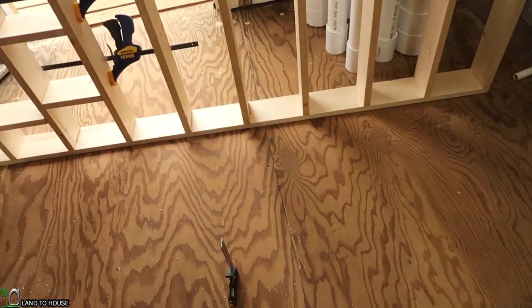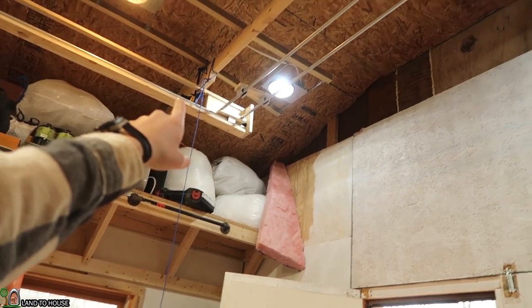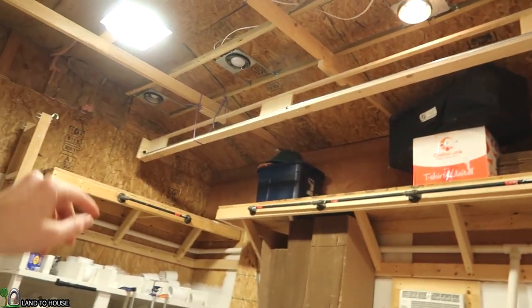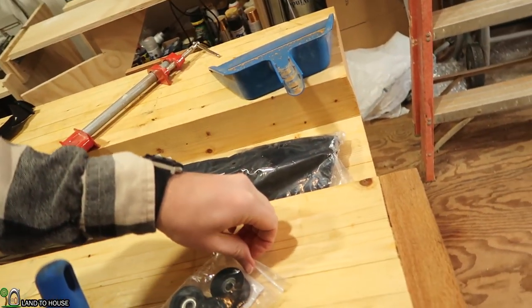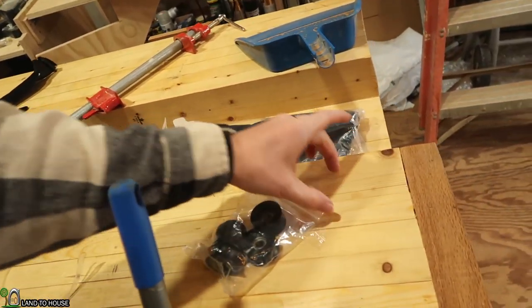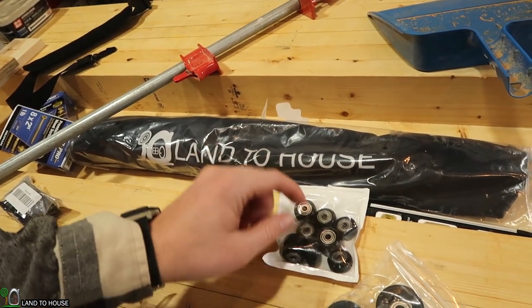While the next set and the glue is setting up, I think I'm going to work some on the camera gantry. So here is the plan. Previously I had tried to use linear bearings — they didn't work. It's linear bearings on these tracks. I'm going to keep the track idea but I'm going to do an adjustment. I'm going to be using these U-groove wheels as the new sliders. That will be on the top, and I'm going to space them out by about a foot so it shouldn't have racking. And then on the bottom of the track I'm going to use these little wheels that also have bearings in them. I'll go ahead and take down those linear bearings and see what I can do.